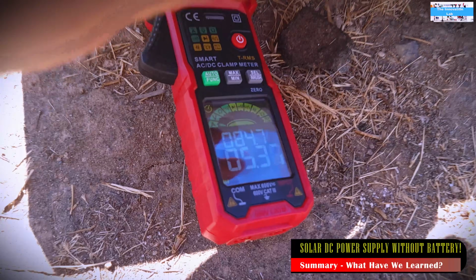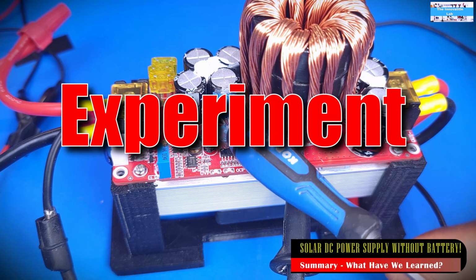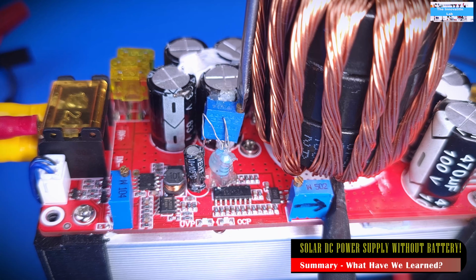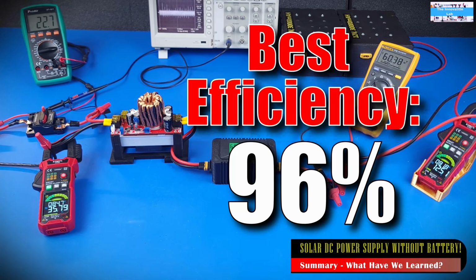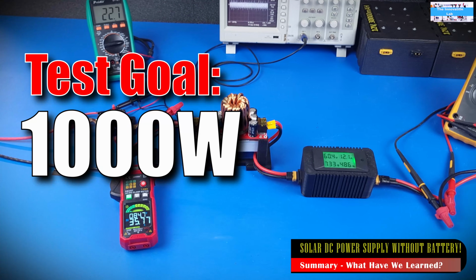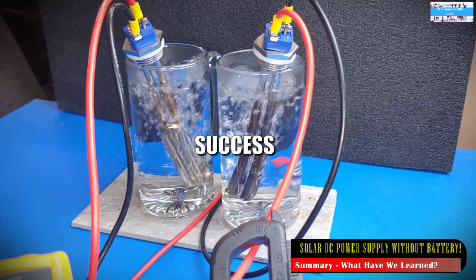All right, so that's it for this video. I hope you guys had some fun, and I hope you learned something from the video. My intention was to run this as an experiment, kind of driven out of curiosity to know if this is actually something possible. And from what we have seen in the video, the modifications we made on the converter gave us a best case efficiency of about 96%. Our initial goal was to see if we can push up to 1000 watts of pure solar power going through the converter and being delivered to our load. And from what we're seeing, we were able to get close to about 800 watts delivered to our load. In my opinion, I would say that is a success.